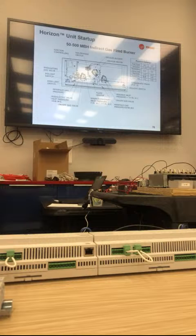So, looking at this burner, it is split manifold. The left-hand side is modulating, right-hand side is on-off. Quick question: typical sites, what is the inlet gas pressure you guys see? Is it 10 inches, 7 inches? 7 to 14. What do you see mostly? 11. Probably 10.